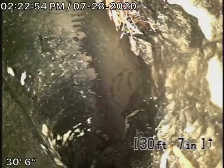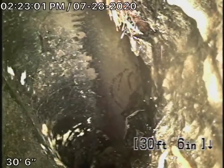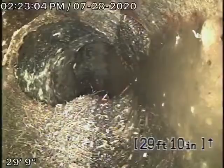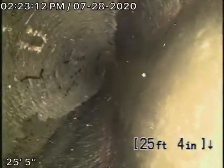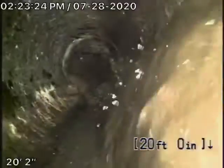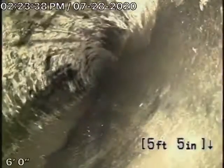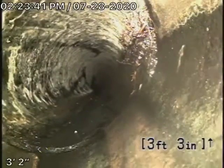There are more roots over there. Right over here is the connection in the driveway underneath the pavers, which picks up the left-hand side of the house — the kitchen and such. That is the connection. You can see the orangeberg is done. It comes underneath the driveway here, with more roots coming into the pipe.